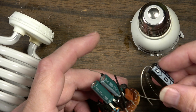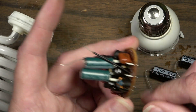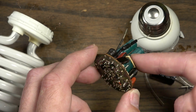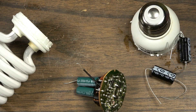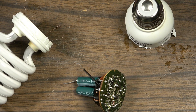I'm going to see if I can get this light to light back up. I'm curious to see if we can just replace those capacitors and get it going real quick. Either it will light up, or it will just blow these capacitors as well. I don't have exactly this value though — it wants 15 microfarad at 200 volts, and I don't have one that's 200 volts. I assumed it was going to be like 150 or 160. But this does have a little transformer here, so I'm afraid it might step up the voltage slightly to something closer to 200 volts. If that's the case, it would definitely blow these in no time. What I'll do is clip in a couple of capacitors with larger values — let's just hit them with 450-volt capacitors.